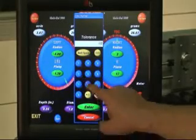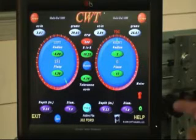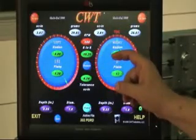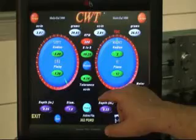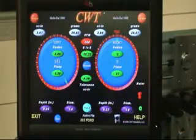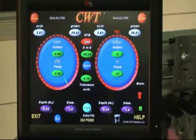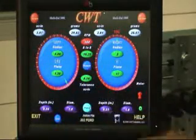Over here at .2 — that's a tolerance we would use for racing standards. That's 28.4 grams in an ounce times .2, and in this particular application that means it would be approximately 1.5 grams left residually in the crank. You can do better, but it's a form of entertainment.